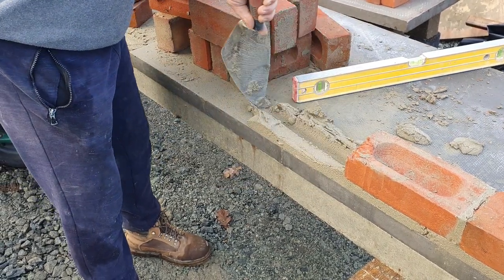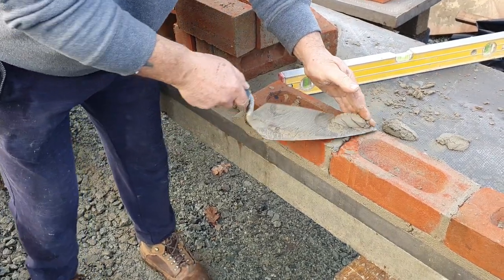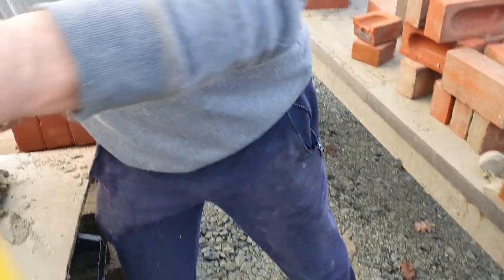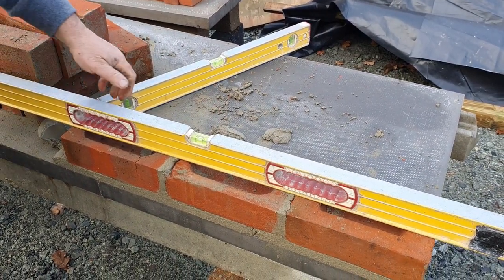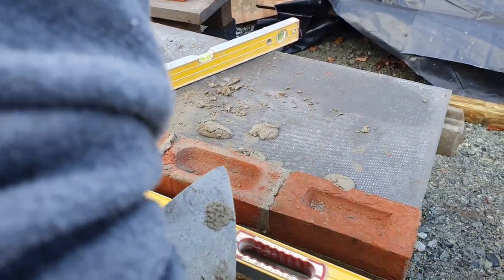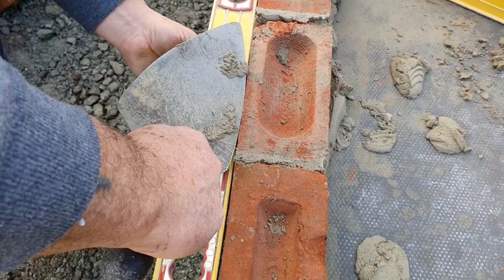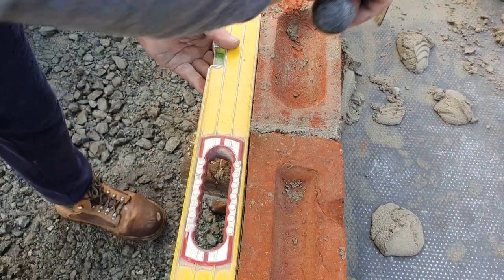Pop the gap in there. The bricks are quite wet. So now I get the old four course to be there. That's spot on. So now I'm going to set it straight, get that in there. The problem you have — you can see them bricks all bent and bowed — you've got to pick a point at which you've got to plumb from.